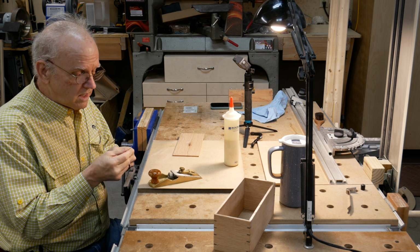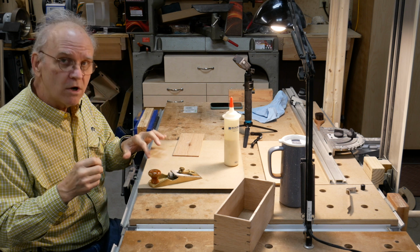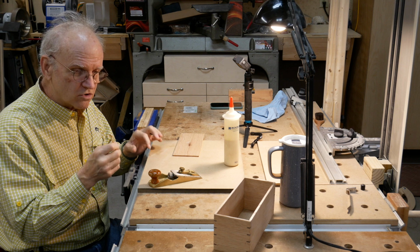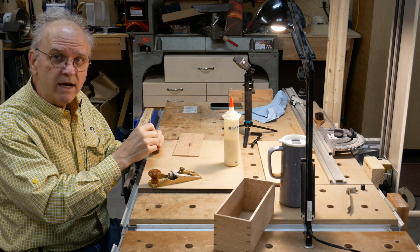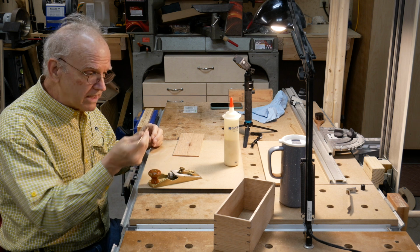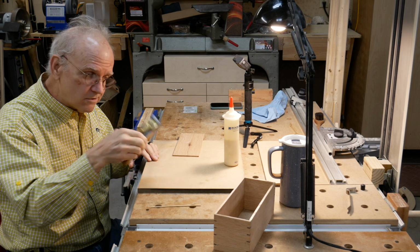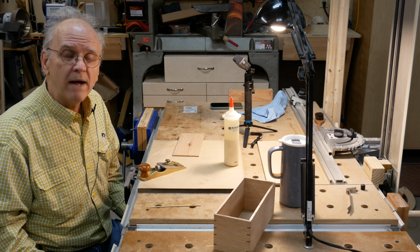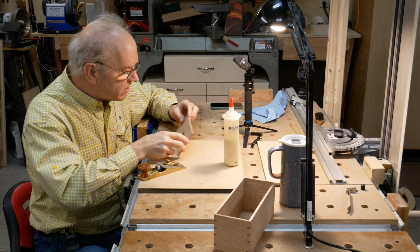They're just throwaways. Sometimes when I have a screw hole that needs to be filled in, I'll take this and I'll dab some glue down in the old screw hole where the threads have been wiped out, and so the screw won't hold anymore. And I'll just drive this down in here with some glue on it, and I may have to drive 2 or 3 down in there. And the bamboo is hard enough and stiff enough to where you don't have to worry about breaking it. But that works great as a wood filler for a hole. And once it gets dry, again, you can saw it off, and then take a chisel to it, and you've got a perfect hole to drill a new pilot hole in and screw something back together. So good uses for these tools in all cases.